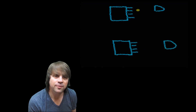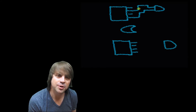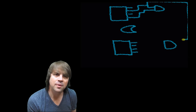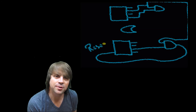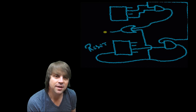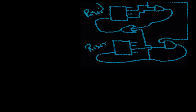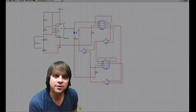In this frame we show how we use two AND gates and an OR gate together to reset our counter at 24 hours. We take a reset signal from B and D and AND that together, and we take a signal from B and C from counter 1 and 2 respectively and AND that together. The ANDed signal from B and C is used to reset counter 2 exclusively, but it's also sent to an OR gate where the ANDed signal from the first counter can also be used to reset the first counter. Here you can see a schematic of the 24-hour section logic setup.